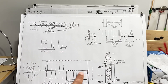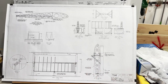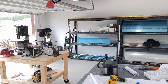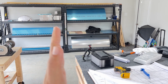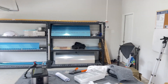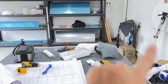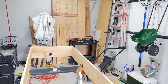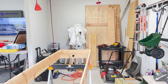Down here in the bottom are the wing stands. These things are set on floor-to-ceiling posts, which is what those four-by-eights are for. I need to decide where they're going to be here in the workshop because they're pretty big — they run like a nine-and-a-half to ten-foot span, so post to post is 114 inches. If you want to build both wings at the same time like I do, you're going to have a wing stand and a wing stand with ideally at least three feet between them.